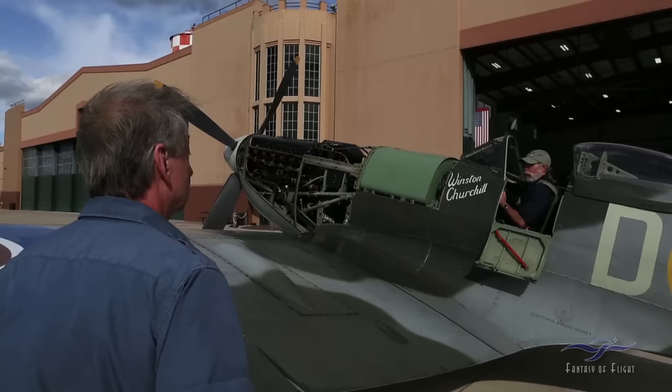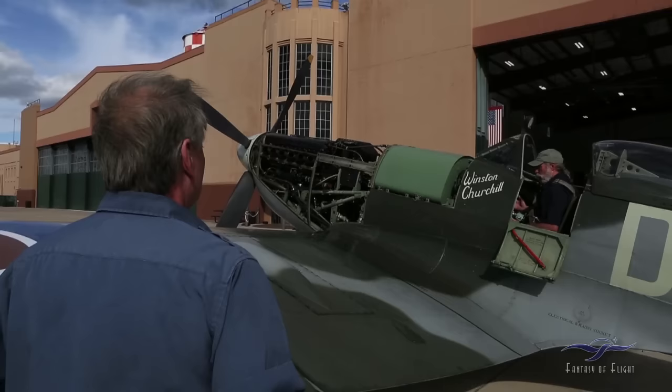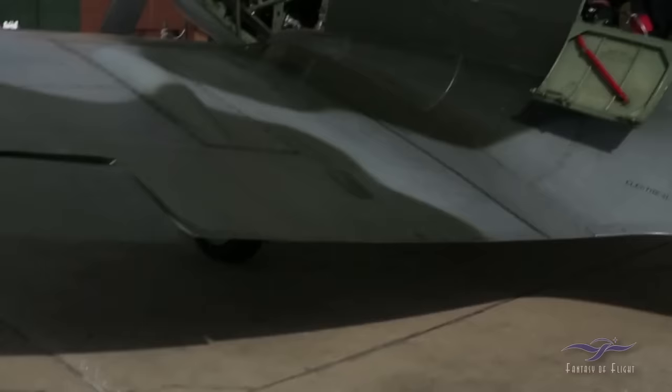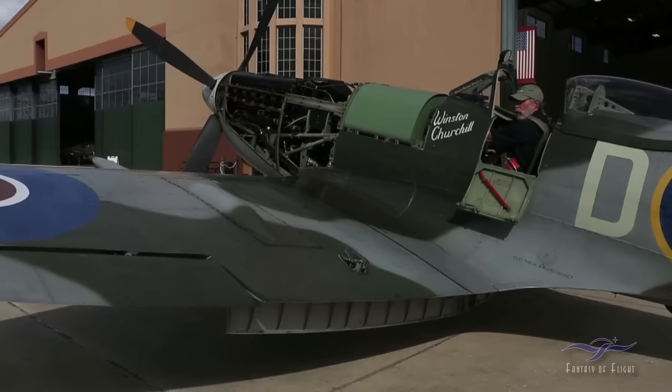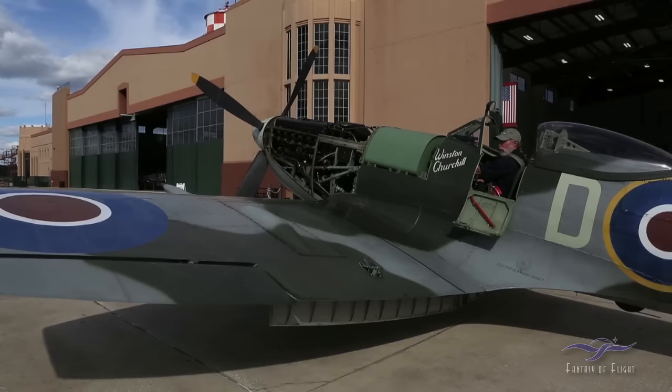Yeah. I'll tell you what, while I'm sitting here, you want to check the flaps because I still got pressure. Yeah. Ready? Yeah. They should be. You haven't got enough pressure. No, but they didn't go down one at a time, did they? No, well, they did there, but you haven't got enough. They should slam down as a pair. Well, they better not go down one at a time. No, you have a problem. Yeah, you got no pressure. All right,